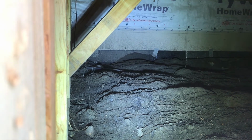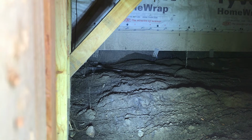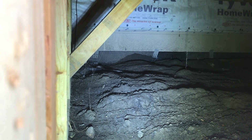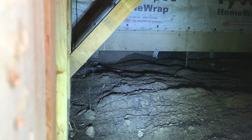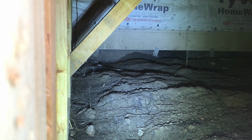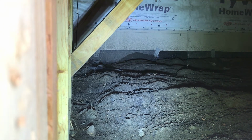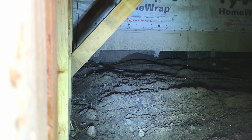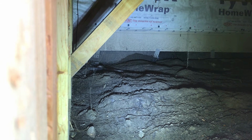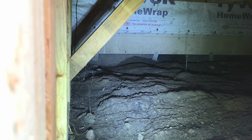Okay, I had Lori go in and click the pump on, just pull the float up, and I can hear it, so it must be right underneath the dirt here, but there's no leaking. It's just that's the first time we have ever heard that. In the springtime now, it's running more often, so doesn't look like there's anything to get too worried about. There's a good check valve on the inside, and it should have good slope all the way back to the drain manhole, so there is no water sitting in it outside here, so there's nothing in it to freeze. But I was just worried that maybe a coupling had come apart or something, but it looks like everything should be a-okay.